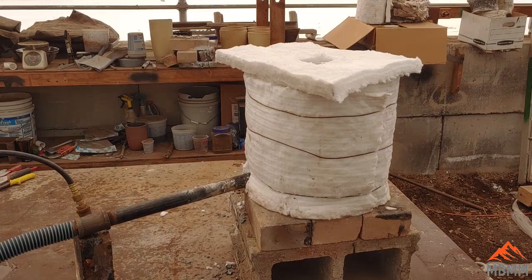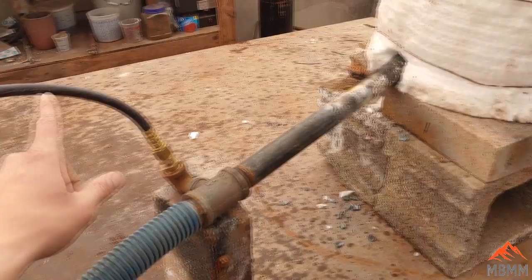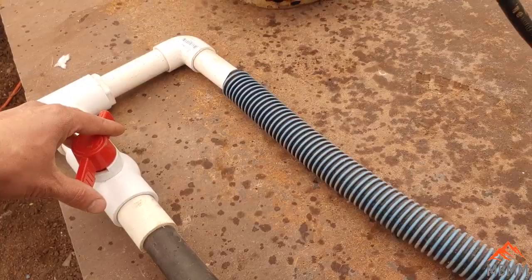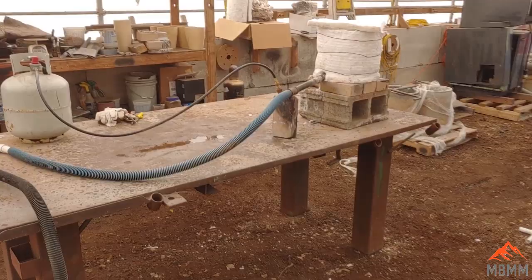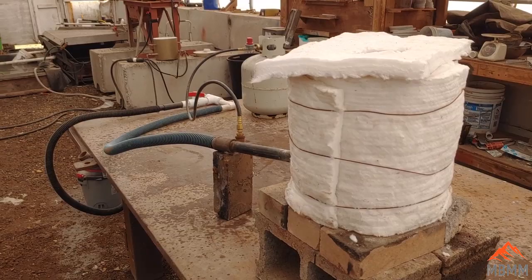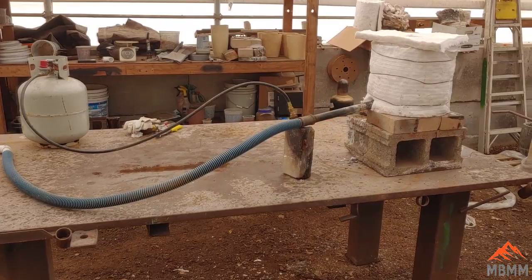Now that it's all set up — there's our furnace, the crucible's in there, there's the cap with wires wrapped, and the propane injector going off to the propane bottle. This is a blower with a valve I can adjust for the amount of oxygen we need, and it literally goes down to a $60 shop vac I bought at Home Depot, turned around to blow instead of suck — that's my air supply. This furnace build cost less than $200, can smelt a number 12 crucible, and took me probably 20 minutes to build. I hope you guys can use the techniques and ideas here to build your own furnace and smelt your own gold concentrates.